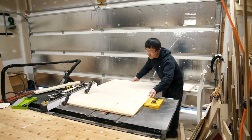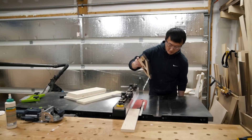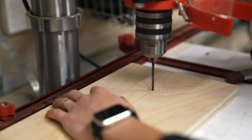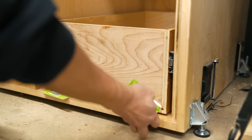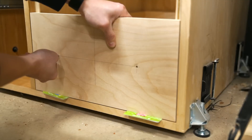And finally with all the drawer boxes in place, I cut the drawer front from one piece of ¾ inch ply. Before attaching the drawer front to the drawer boxes, I first marked down and drilled holes for the drawer pulls. Here I'm using some very expensive spacers to help me place the drawer fronts in the proper location so that I could mark and drill the corresponding holes in the drawer boxes.